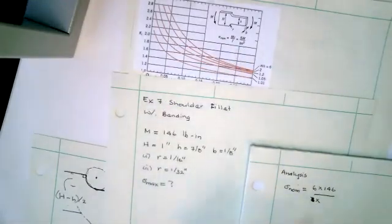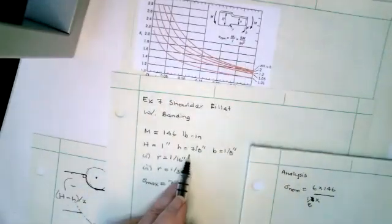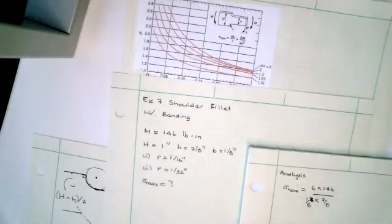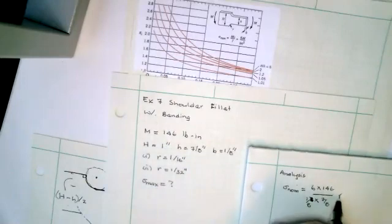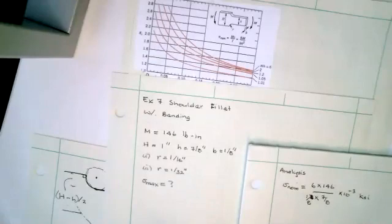b is 1/8. And h squared is 7/8 squared. And if I calculated that, it would be psi. I'm going to multiply by 10 to the minus 3 because this sort of moment is going to produce stresses in the thousands. And so it's easier to work in ksi. But people don't always do this. It's not required that you work in ksi, you can work in psi. You'd just be carrying around a bunch of zeros, okay. And if you calculate this,